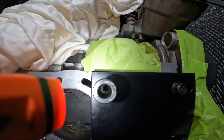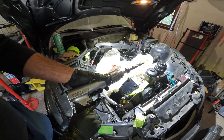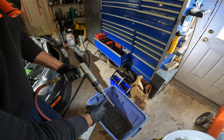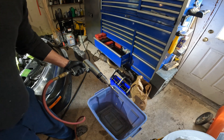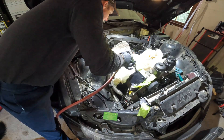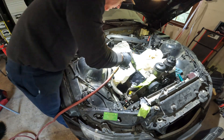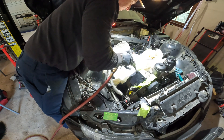First step is to drill it out using the step drill that comes in the kit. You always want to lubricate the bit — I'm going to spray that every time. I'm going to drill this out in stages because you have a lot of chips and you have to make sure those chips are removed. This guide is going to help me drill it straight and prevent me from making the mistake of drilling at the wrong angle.